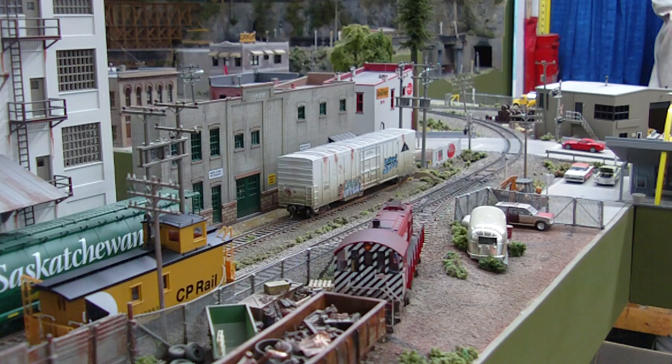There's not a lot of room in this locomotive. I used a sugar cube speaker which I mounted on the rear truck, and you can't really quite see it, but it's in the rear window. And the capacitor is just behind the motor, and I made a metal bracket that goes almost over the front truck to hold the micro Tsunami, so it acts like a heatsink.